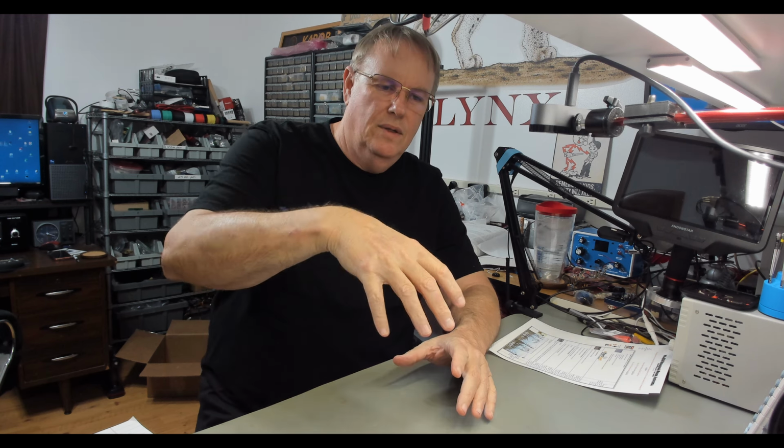But as far as the Hexbeam, I set up the Hexbeam and built it. They recommend you put a bucket on the ground, put a pipe in it with concrete or sand, set the center section on and start building your antenna on the ground, hooking up your coax and making sure it looks good, SWR and stuff, before you put it up on the tower.